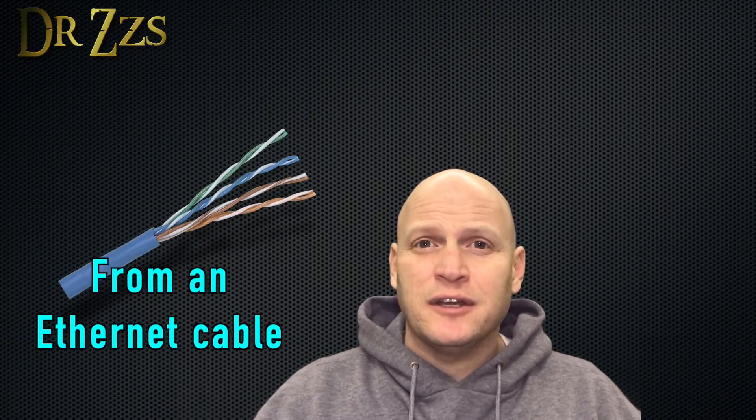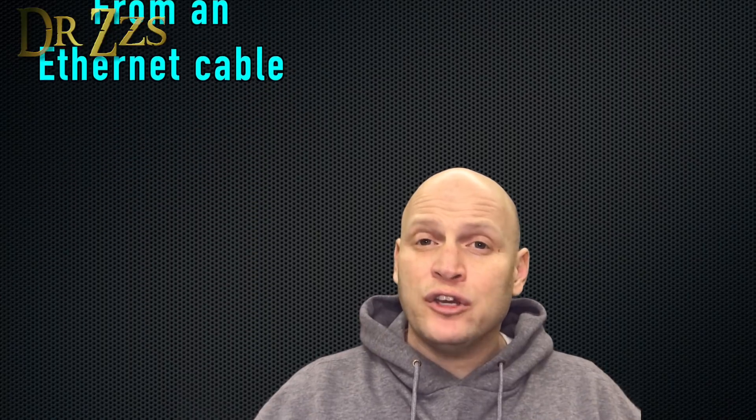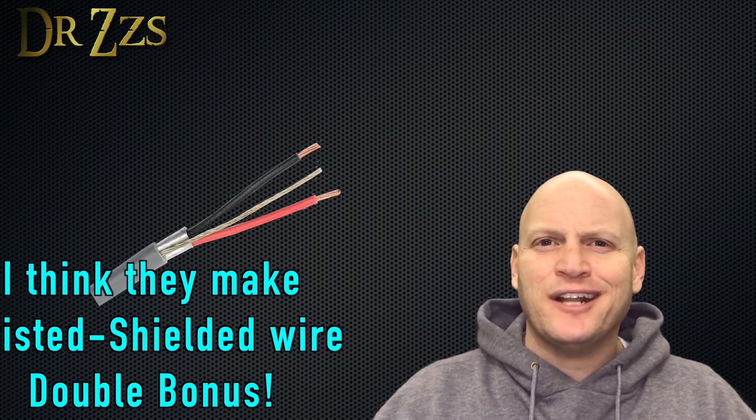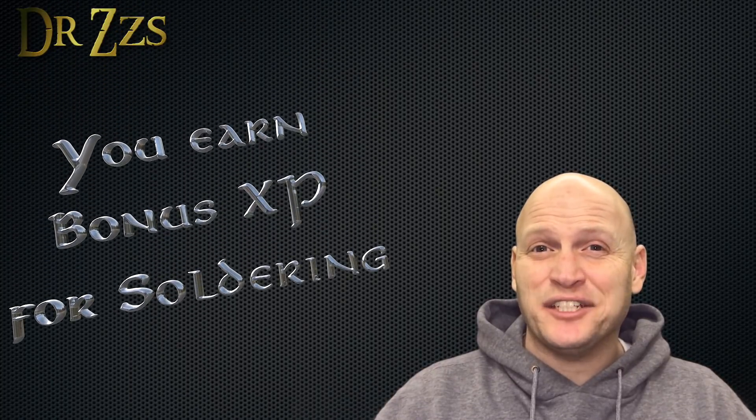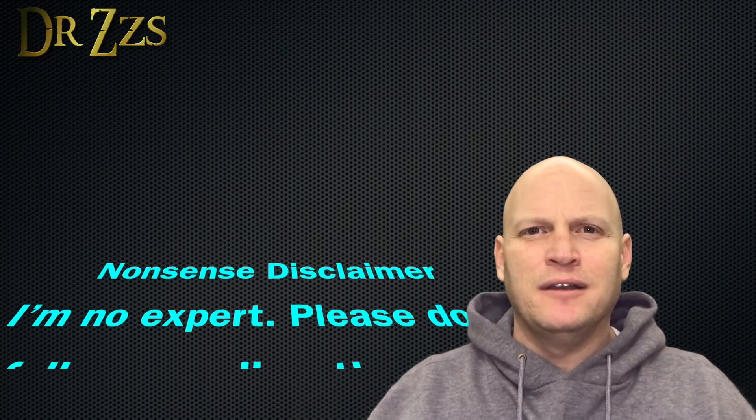That's it - hopefully that'll be the end of any ghost switching problems. If you don't want to mess with resistors and capacitors, you could also try using twisted pair wires between the board and your switch, or shielded wire. But learning how to use resistors and capacitors is pretty cool, and the more we get into hacking electronics and doing things around the house, the better off we'll be knowing how to use these components. Hope that was helpful.